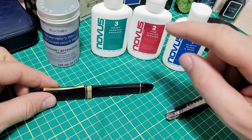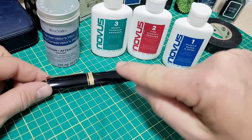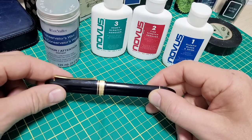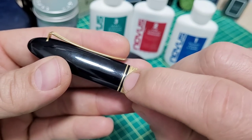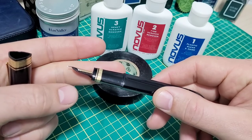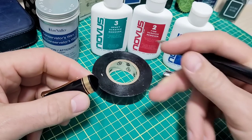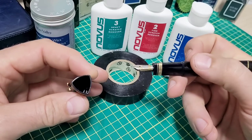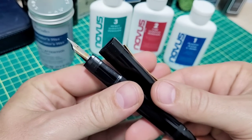We're going to try to go with the least amount of stuff to get it looking the best. If I have to go with a heavy scratch remover or even a light sanding like micro mesh, I'll save that for another video. The X-Acto knife is for the tape — I'm going to tape off these bands here and the one down here just to protect them, because the plating can be quite thin and fragile. We'll just go with the number two, buff that out, polish it up.